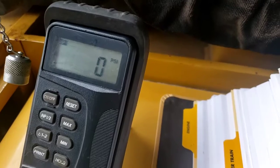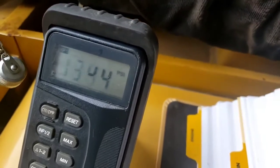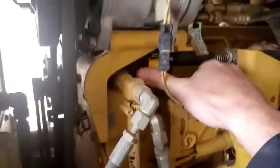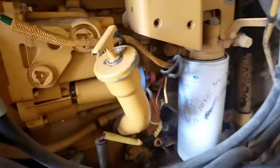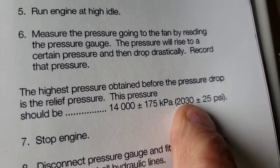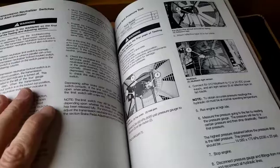There's the pressure at idle. So here we go - revving the engine. It looks like we're going to about 2,050 psi as our maximum pressure, and our spec for that relief is 2,030 plus or minus 25 psi - so we're bang on. We didn't need to block off the return out of the motor at all. Just rev the engine up and you're going to see your maximum pressure.